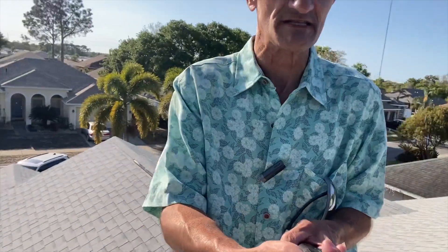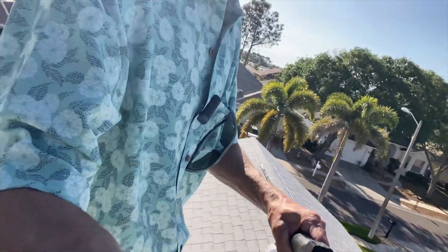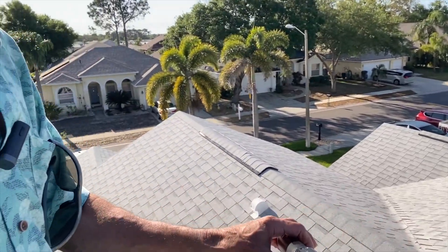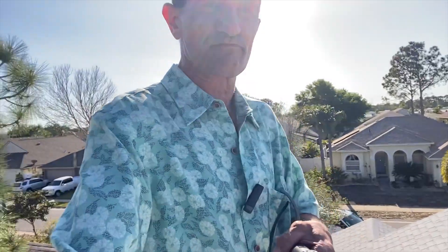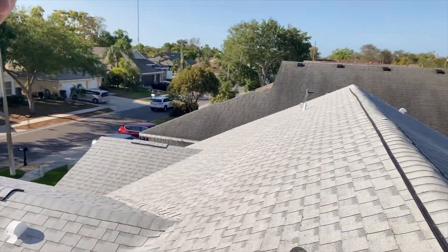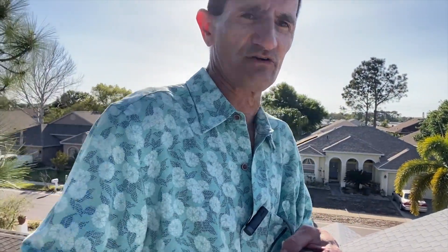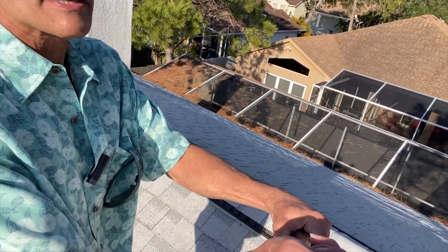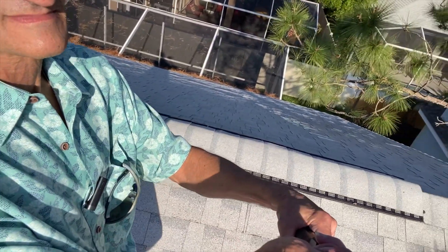However, this west-facing roof is the front of the house and it's very chopped up — see how those intersecting roof lines? The solar pool heating panels are four feet wide and come in lengths of 12 feet, 10 feet, or 8 feet. Because of all these intersecting roof lines, I would not be able to get a bunch of rectangular panels on that roof. You're better off with a very simple roof like this back roof — no intersecting lines. The simpler the rooftop, the better; the more we can fit these big square panels on.